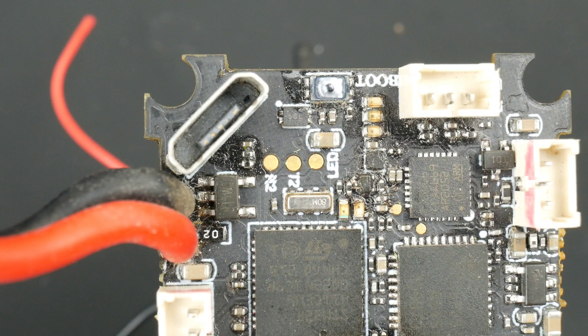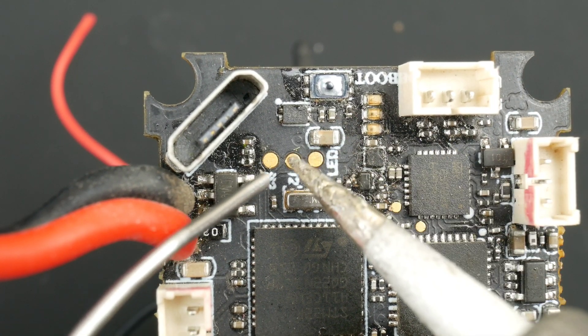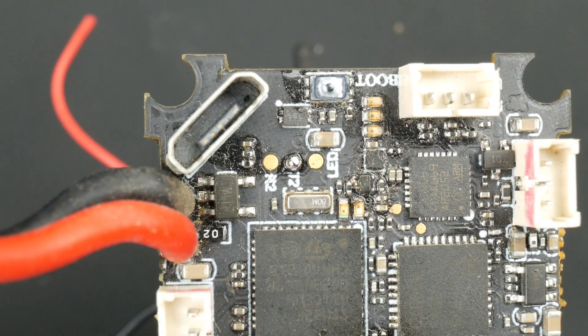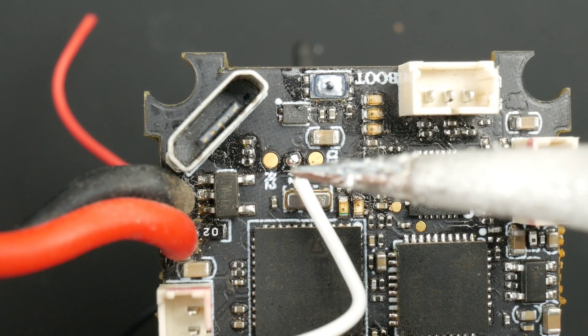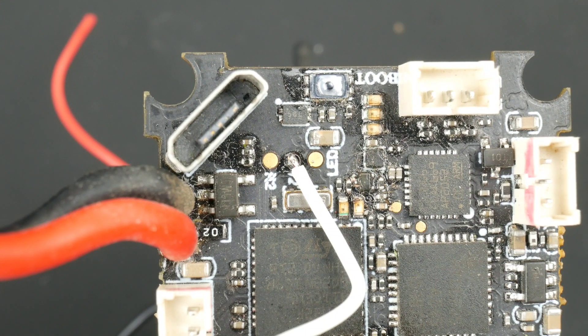The hard soldering bits are now done. The last bit of soldering I'll need to do is the T2 pad, which you can see in the middle there. I'm just going to tin that up and then wire it up as well. The pad is now tinned — I'll get a wire to hook that up. That looks okay to me. It might need a little bit more flux but I think that's a good connection anyway, so I'll go with that for now.